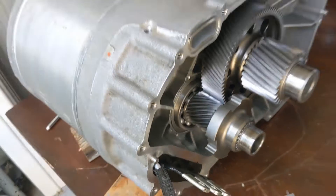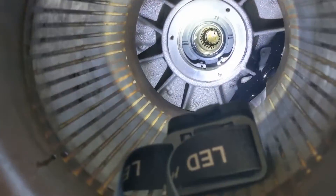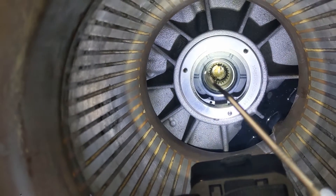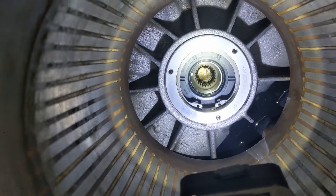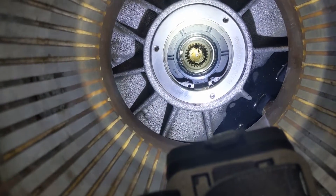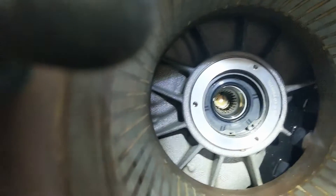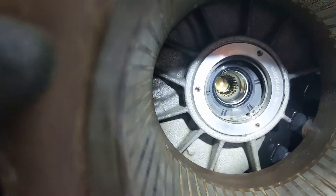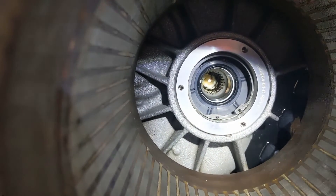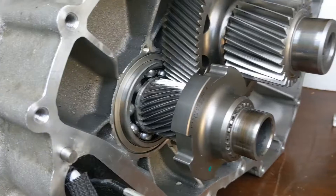We're roughly halfway. We stopped and tilted this piece of metal and now we can inspect — maybe with a feeler gauge — if the shaft is properly going into the seal and the seal is not folding double. I forgot to say that before I put the shaft in, I put a little bit of oil — Dextron 6 — both on the seal and the shaft outer surface so it's easier to pop it in.